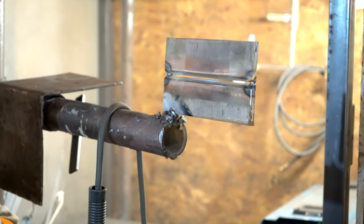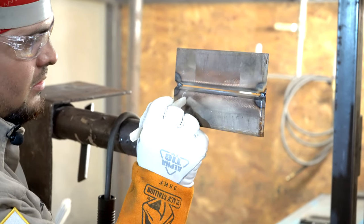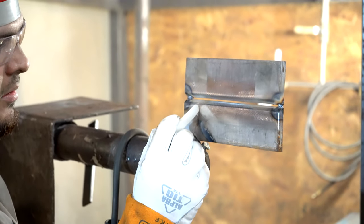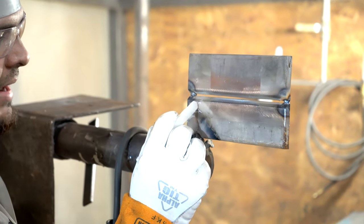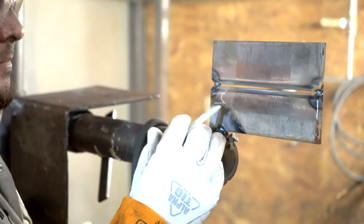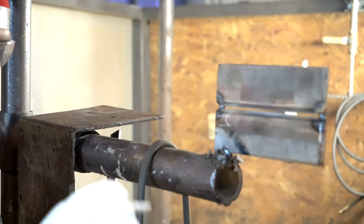Okay, so I'm gonna have the keyhole, right, little keyhole, and I'm gonna come out of it, break down my bevel walls and then come back inside the keyhole and add metal. All right, so once I go forward and come back, I'm adding the metal, I'm controlling that keyhole. You need to control the keyhole.